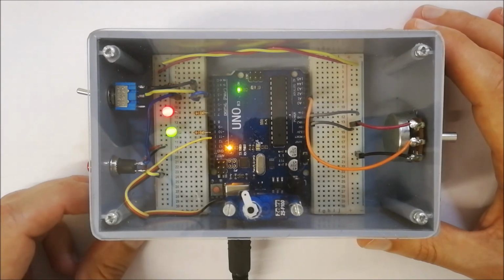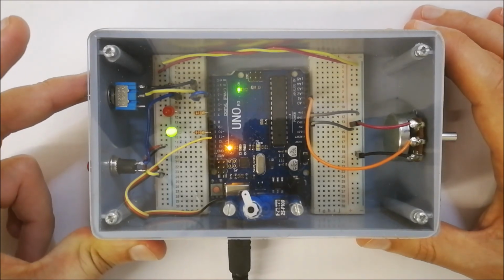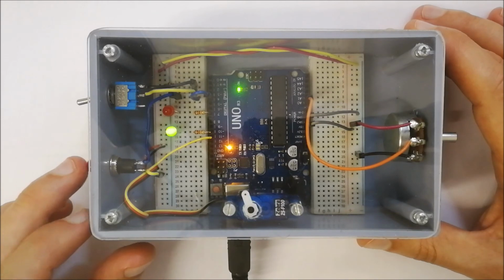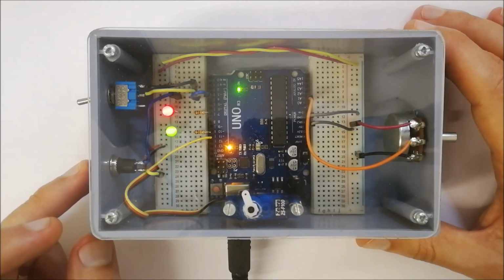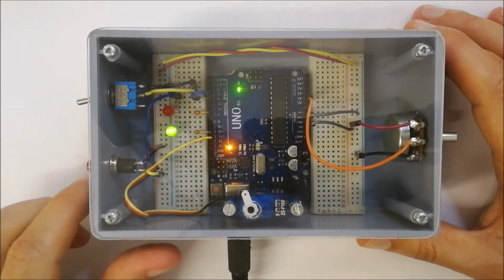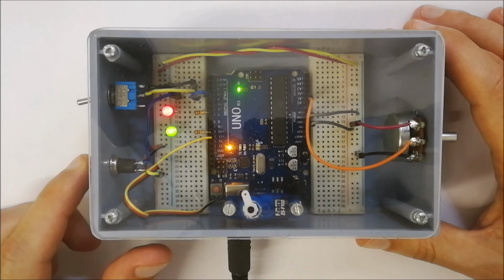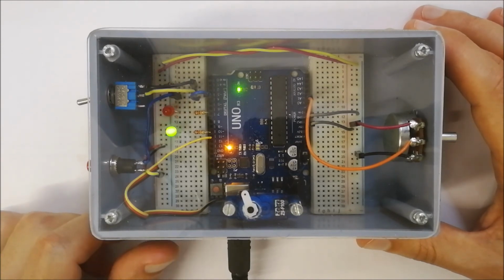Now, if you see how long it takes to switch off over there, it's quite some time. That's why with the pull-down resistor, with the switch connected in series with it, when I push it, it goes on. When I release the button, it goes off immediately, because that charge is dissipated on that specific pin immediately as well. Okay, so we know that is working.